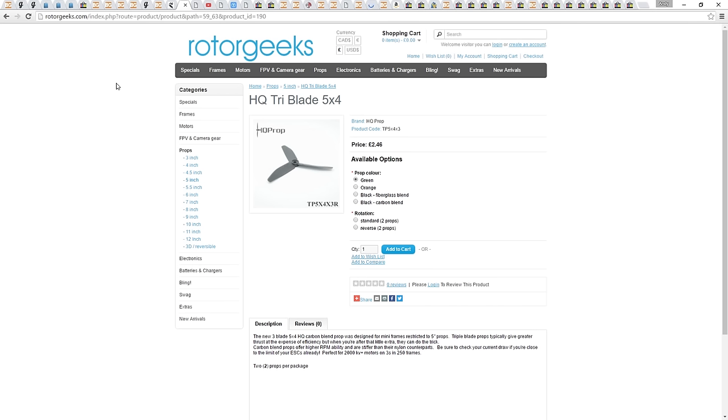You can also think of it like a drag racer. It has ample power and will run the quarter mile as fast as it can, but throw a corner at it or try and make it stop without a parachute and it's useless. The same goes for our setup. The 5-inch prop is a nice middle ground of power and agility. I will be using the Nylon HQ 5040x3 props. Get lots of them as they break so easily. A clip to the ground can take a massive chunk out of them, especially with these high RPM motors.